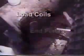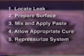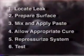The air repair system can be used to seal a variety of pressurized components, such as valve stems, end plates, and load coils. The process is straightforward: locate the leak using pressure testing soap solution; properly prepare the surface; abrade and clean the surface with a solvent wipe; mix and apply the unreacted paste in about a two to three minute period. The sealant hardens and cures in five to fifteen minutes, at which time it will hold over 10 PSI (700 millibar pressure). Check the repair with a soap solution. If the cable has been moved from its normal position, it should be re-racked to its permanent position immediately after testing.